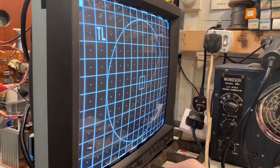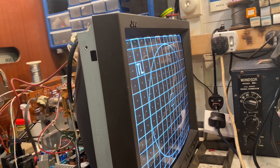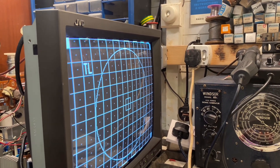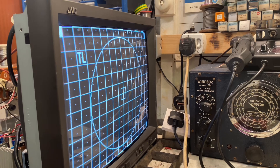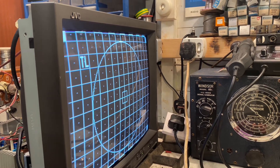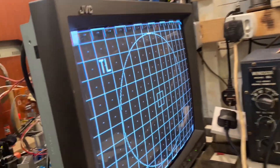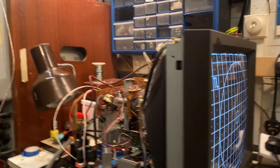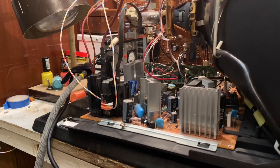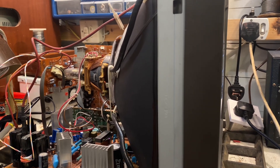The HT rail fluctuated quite a lot - there's a fairly low smoothing capacitor - but it measured fine so I'll be leaving that. I've added the external heater winding to boost the heater volts. Focus is good. You can get a sharper picture if you lower the G2 a bit, but then the picture becomes too dark. It's watchable with all the workshop lights on and actually looks fantastic with all the lights off. Going to button this one up now and tidy up the wiring and winding - I've put a bit of varnish on the winding to hold it together and I'll put a zip tie on there as well.